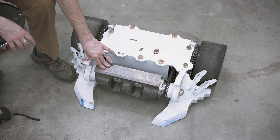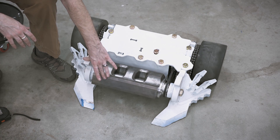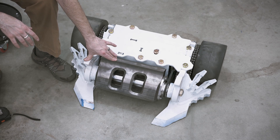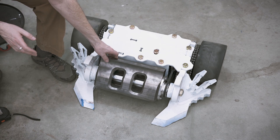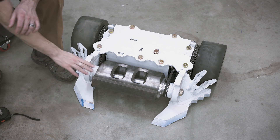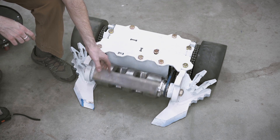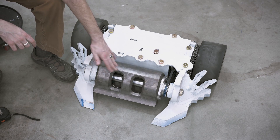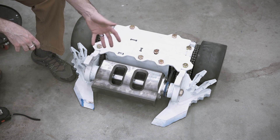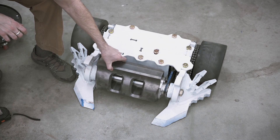To give you some specs and numbers: we're going to be hitting around 6,000 to 6,500 RPM if all goes well, and that should put us at a tip speed of about 165 miles per hour. I don't have the exact kinetic energy numbers, but I'd say it's pretty average — we're not up there with Tombstone or anything like that. Given a good bite, you could see tens of thousands of joules worth of kinetic energy, right in line with pretty much any heavyweight out there. I wouldn't say our weapon is anything exceptional — it's pretty much right in the middle of the big heavy hitters, although it does have quite a bit of weight up front.